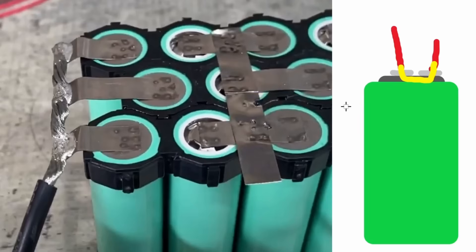There are some other parts about my spot welding that aren't very good. Right here I just blew through the nickel for some reason. All over the place I'm spot welding right on top of the plastic. And right here I'm spot welding right in the middle of the negative terminal of the cell, which is a bad idea.